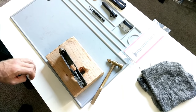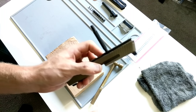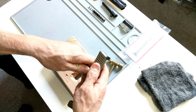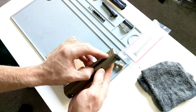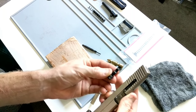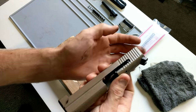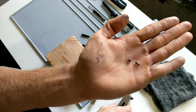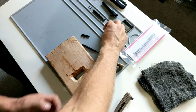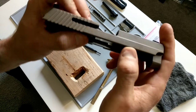First one's out. You can see I've got the tool holding the extractor in place, so now we'll slide that out — I'll keep my thumb on the extractor. You'll see that it is now loose and will slide out. Be careful because inside the slide there are two springs which will fall out — the small one just goes inside the large one when putting it back together. Set these down.